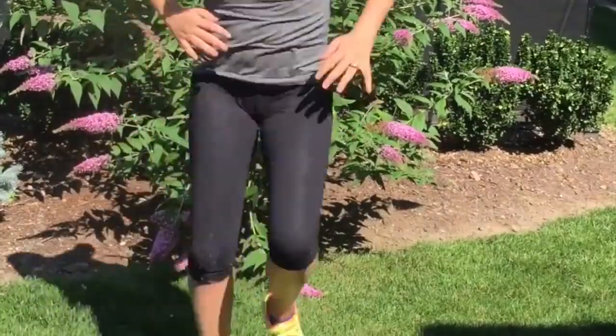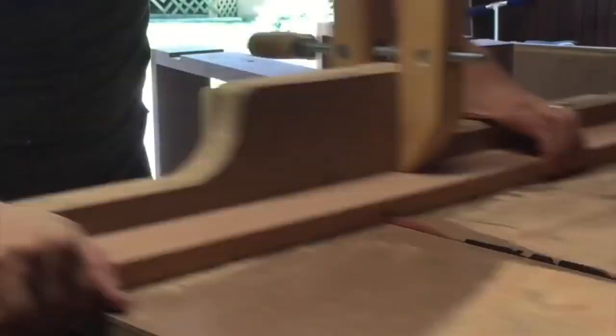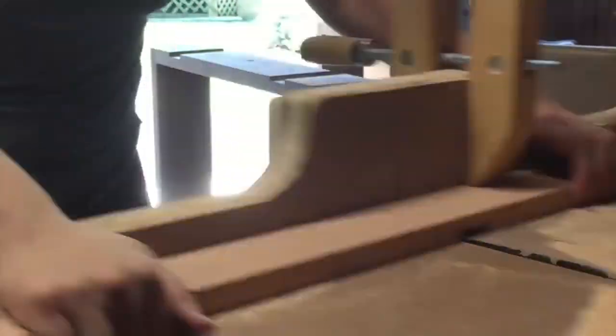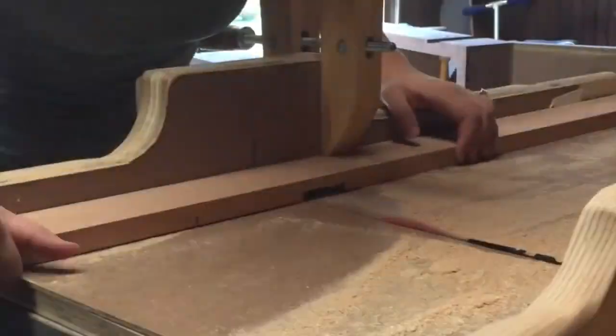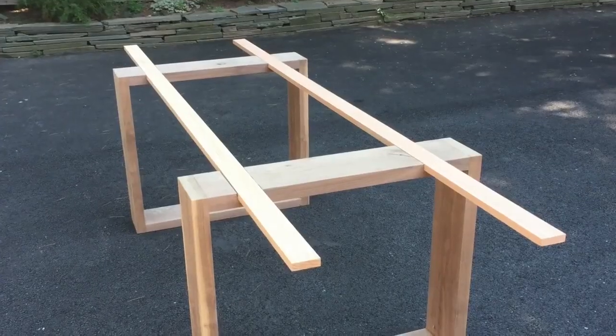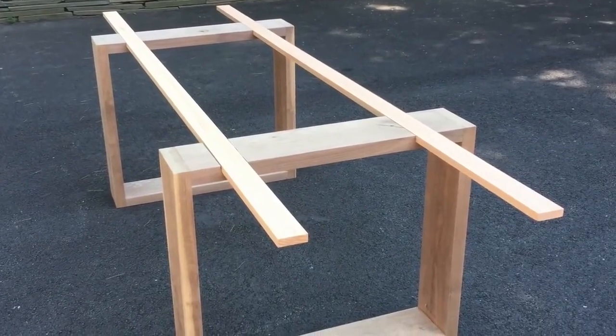Routers are really, really messy. I used my crosscut sled again to make notches in the supports — I'm making a half lap here. I need a dado stack; this is a little bit tedious, but it works! The oak supports now fit perfectly into the legs, creating a flat surface for the plywood to sit on.